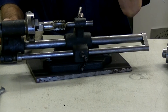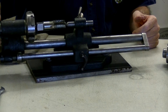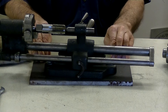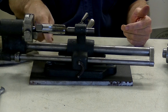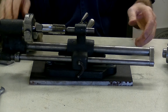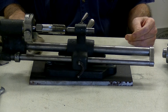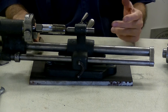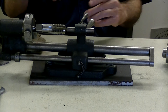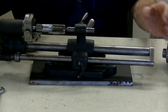Also over the back is a spring that is way too long for the job it's supposed to do, but it's supposed to leave a little bit of tension on the body so it goes back to rest. Now, originally when I bought this attachment it didn't have a base — there's a spigot sticking down from the main housing. I thought this was negligence on the vendor's part, so I made up a nice base that clamps down on the tool and cutter grinder table. I got the instructions about a year later, and as it turns out there is no base — the spigot goes in the T-slot of the tool and cutter grinder. The attachment is built around a Cincinnati number two or a similar size tool and cutter grinder.